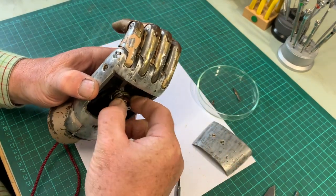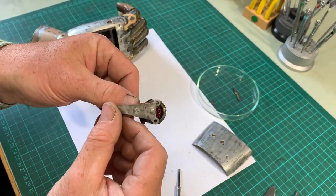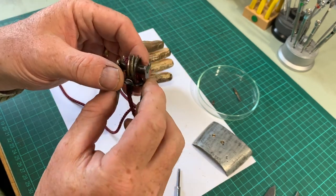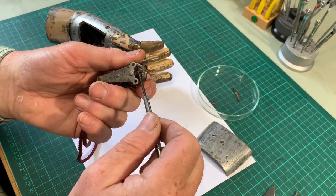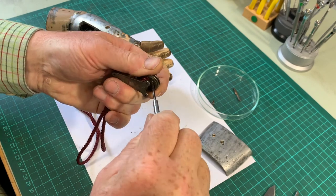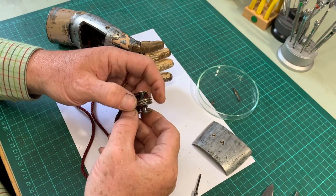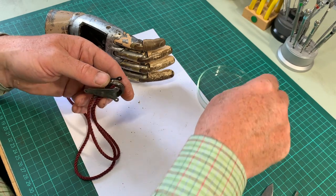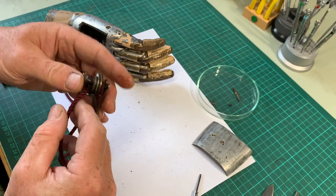Once the worm is removed, you can see that the cord is held secure in a diagonal hole, clamped by a pointed grub screw. I removed the screw, which thankfully hasn't corroded in place — it's a very small screw with a sharp pointed end that goes right into the leather cord. And now the cord should be free to pull out of the diagonal hole.